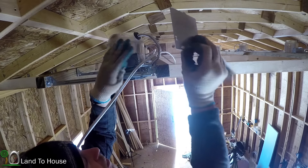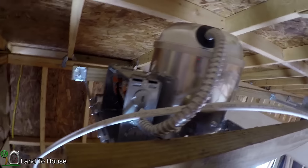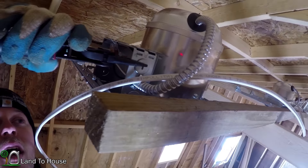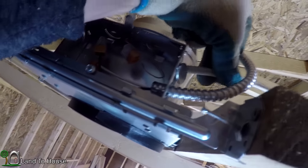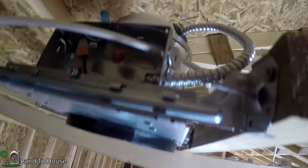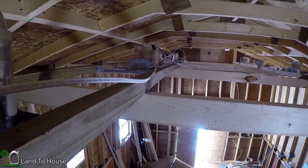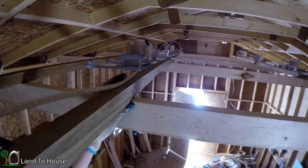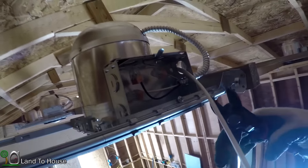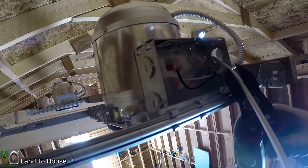I'm going to pull this metal sheet off. If you look on the box there is a metal tab that needs to be pushed open. Normally you would install a wire holding device, but I'm not going to use that today. I'm going to take my wire, place it into that hole, and pull out until I find the spot I want. I want to be able to hammer down a piece to hold this in place, and I need this wire to stick out of the box about four inches, so I'm going to cut right here.